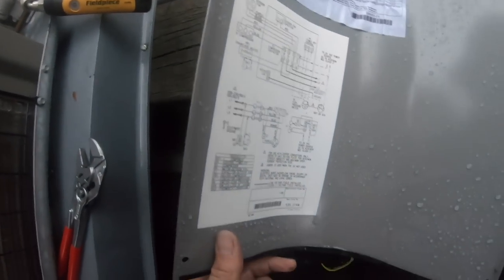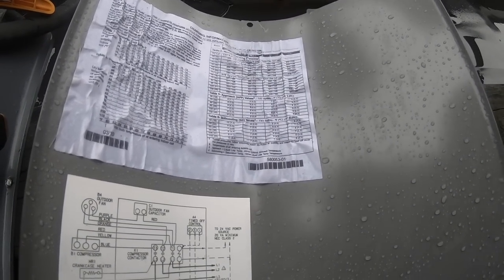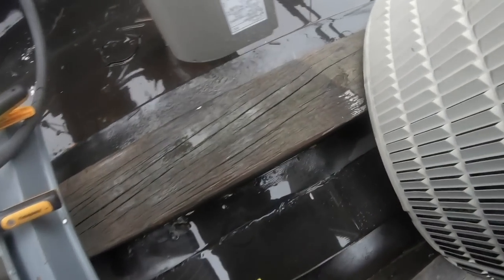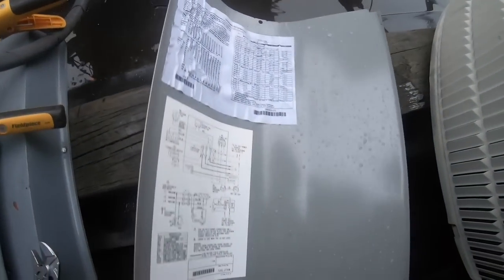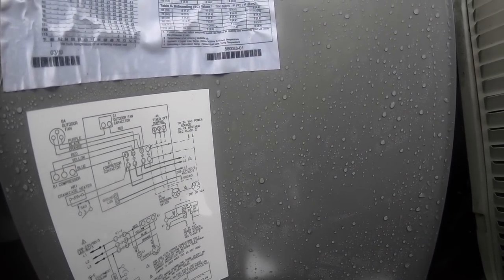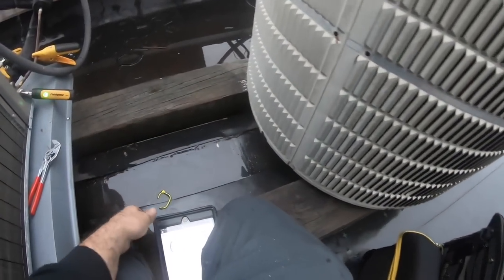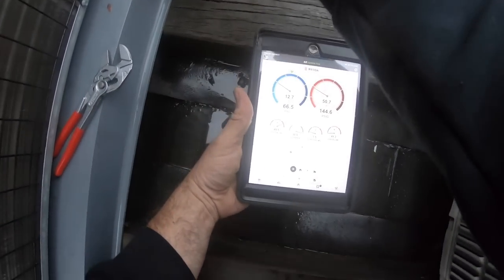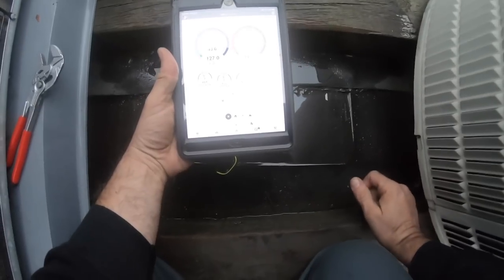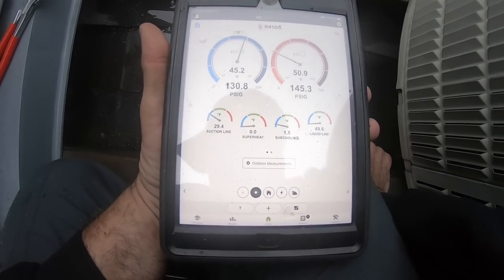So I'm gonna write down in the door what it should be. So subcooling on this machine. I'm on a, what's the tonnage? 5 ton. 5 ton machine. It's the last column. Right now we're 65 and under, about 8. I need 8 degrees of subcool. So nowhere near 8, so let's add more. At least we have subcooling, which is better than not having anything.